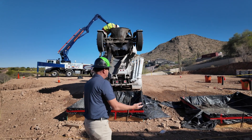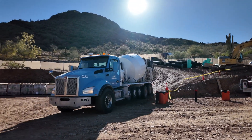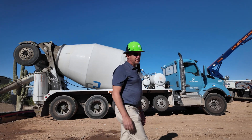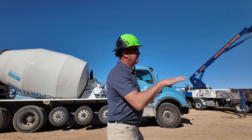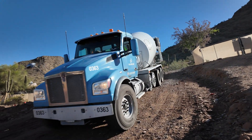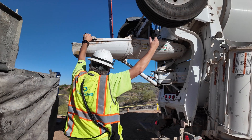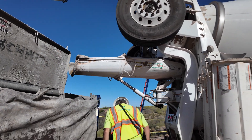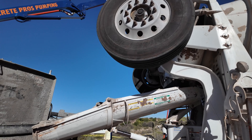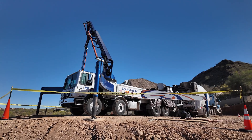These are our clean-out pools. The little kiddie pools won't work on this one — it's a 400 cubic yard pour, so we're going to have probably 40 to 45 trucks coming in and out. They need a place to clean out, and we have to contain the concrete so it doesn't go out into nature. We were going to do a double pump on this pour, but the traffic area was going to get way too tight. So we went with one big pump and two trucks at the pump, coordinating getting them in and out. If we had another pump set up, it would get too chaotic. The two trucks come in, dump into the pump, pull forward and clean out, while two more trucks back up to the pump — creating this rotating dance.